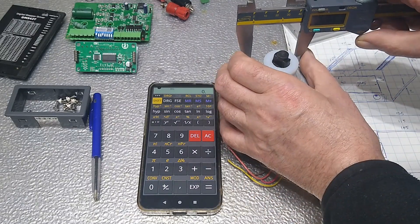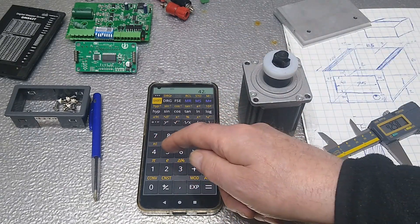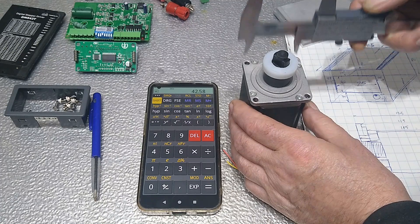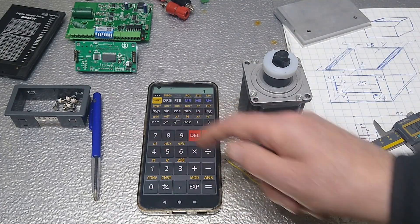I have set the X and Y axis of the digital readout to 0. The inside dimension from hole to hole plus the outside dimension from hole to hole divided by 4 gives one number for all four hole coordinates.